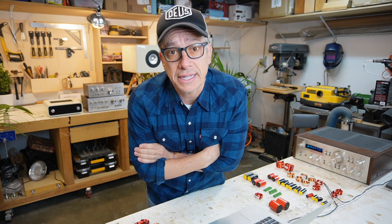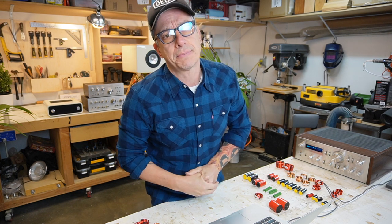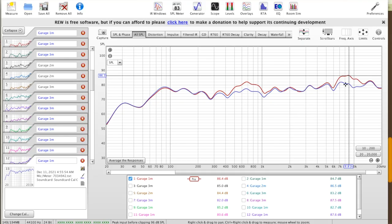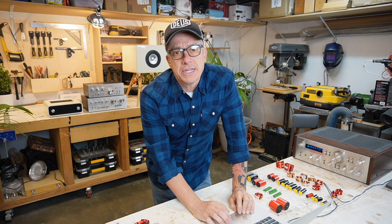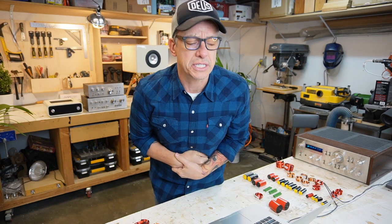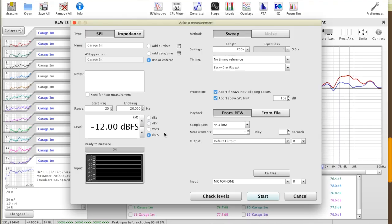Let's put the microphone at listening distance now and get the curve. So, at the end, we forgot about the baffle step compensator. We're just gonna use the filters for mids and highs. We can try and lower this high-end part of it as a whole, but I think it's too much. So let's focus on our 3 meters, on our listening position, okay? It's going to be at around 2.7 meters, which is what? 9 feet, right? Let's do it. Let's get the curve. We need more volume, like a couple clicks more. New curve.